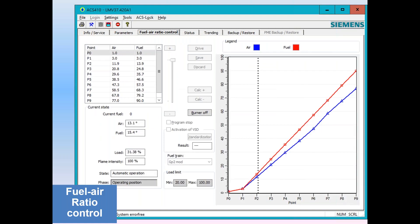Next, you go into the fuel-air ratio curve and can view your curve. This is a beautiful screen for viewing your curve. When you're on the AZL, you simply get the chart — the points set in there for air, fuel, and VSD if you have it. In this case it's just air and fuel. It then prints you a graphical chart, which is very nice to see. If you had bumps in the curve, you'd be able to see them very visually with a graphic output. In this case we have a very smooth, almost linear curve — a pretty well-behaved burner.